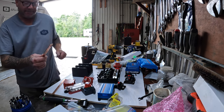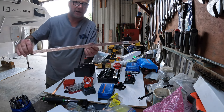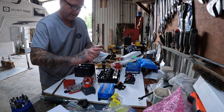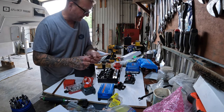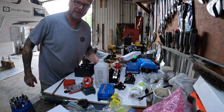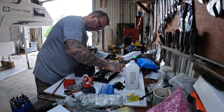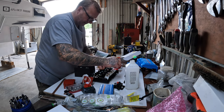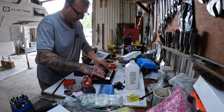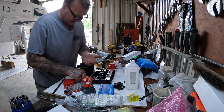When they ship stuff like this they'll put a coating on it — this is the whole bus bar I ordered and they put an oil coating on all of it. So I want to clean the surfaces, make sure there's no burrs, clean it with alcohol. I've got my pads and the alcohol here. I'm also cleaning the contact points on my distribution block to make sure there are no oils on it.